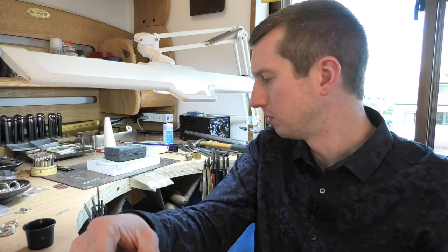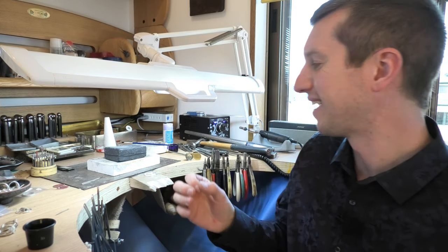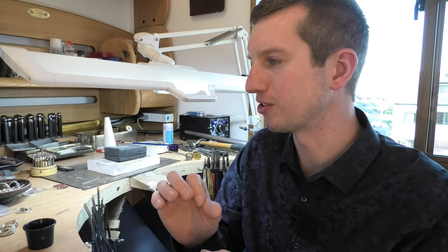I just cannot stress enough how important it is to have really tight, close joins before you solder — before you add any solder. Get that join correct: two flat surfaces together, not open this way or that way, top or bottom — just no gaps. All lined up as well. For the time you spend getting it all perfect, you're rewarded with as strong a join as possible. You need the minimum amount of solder, so you can solder it quicker and easier. It's more likely to flow exactly where you want it to go, and it's just less time cleaning up. It is just a higher quality repair or join — it's really the essential way to go.